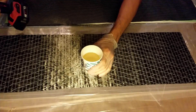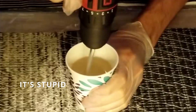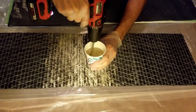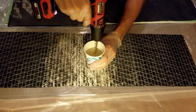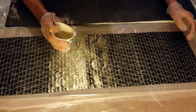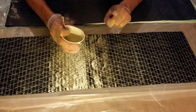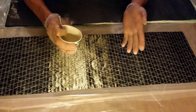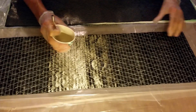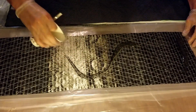Or, if you do things the way I recommend, about three seconds. Now that it's mixed, I want to make sure I get it out of the cup as fast as possible because having this much epoxy resin in one spot can make itself overheat. The reaction produces heat, heat makes it react faster, and things can get out of hand pretty quick. So I'm going to spread it out over a large area as fast as I can.